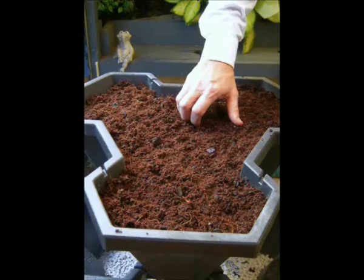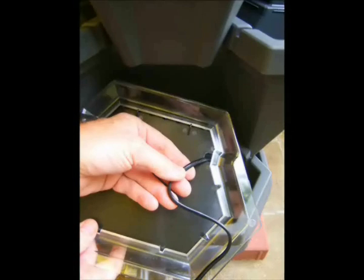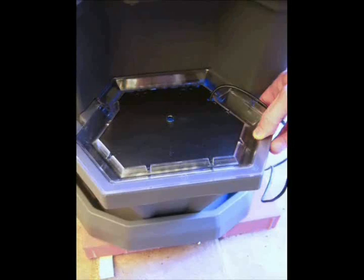We will now proceed to fit all irrigation gutters. Firstly, thread the submersible pump lead through one of the gutters and clip in a black insert from beneath. You will notice that the insert is provided with a notched out area for the lead to pass through. Continue to fit the remaining 2 inserts to gutters and fit them into the openings of the solution tank. These gutters with inserts cover the solution tank, preventing any foreign matter entering the region.